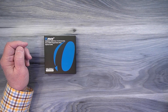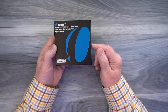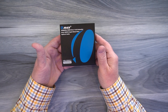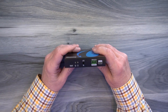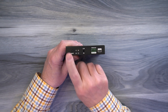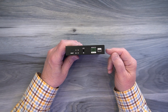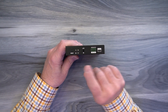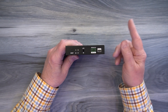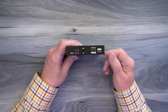Let's start with the transmitter module. On either side of the cabinet you'll find ventilation slots designed to let any heat that develops during operation escape and keep the electronics inside at a very comfortable temperature. You'll also find mounting holes on both sides that can be used with the included bracketing kit. On the front of the module starting on the left you'll find a reset button, which can be used to reset the module by holding it in for a few seconds. To the right is a power indicator — once the module passes its internal power-on self-test it'll light that LED. To the right of that is a transmission indicator, which comes on once the handshake between the transmitter and receiver modules is complete.